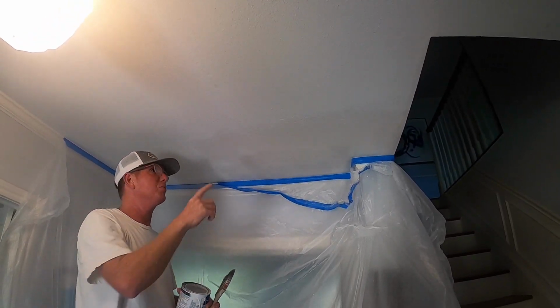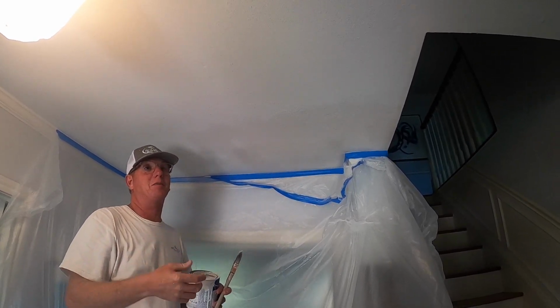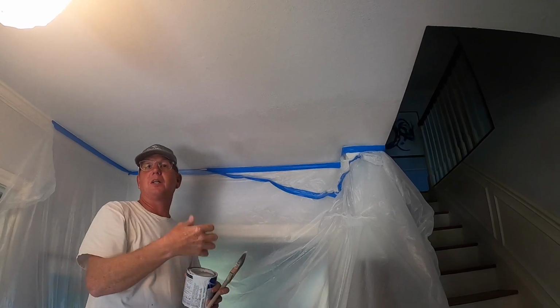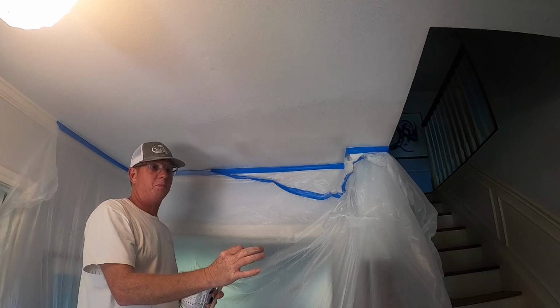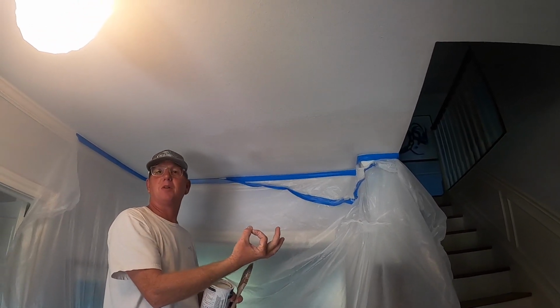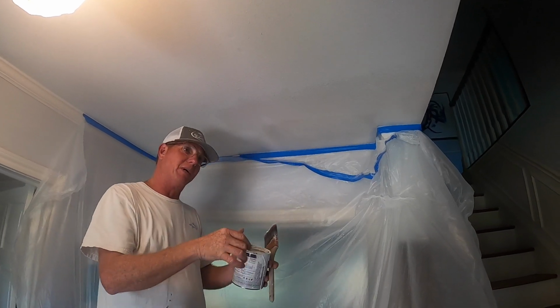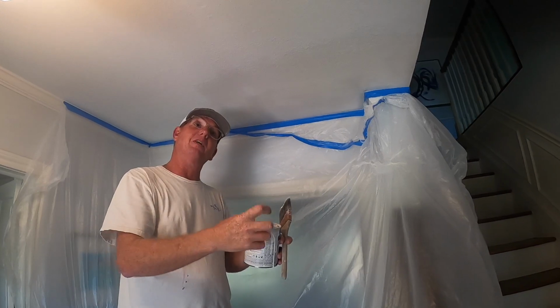What I like to do when we do a match, or if they don't have the paint, I'll cut a small piece out somewhere near my repair and then get that matched at Sherwin-Williams 200 flat. You need about a 50-cent piece or so, 2 by 2 inches, and they'll actually take a picture of that, and then they'll paint a little splotch on there, dry it with a heat gun, and then show you.